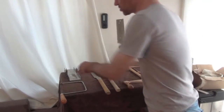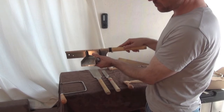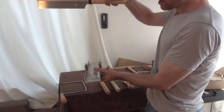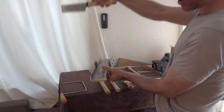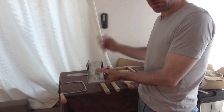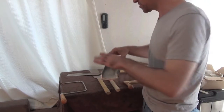When I do fret slots, I have a miter box. A miter box is really important because it means that when you're cutting the frets, you're cutting at 90 degrees. If your saw comes down at an angle rather than straight down, then if you sand away some of the fingerboard, gradually your fret is going to move and it's going to affect your intonation. A miter box is actually a really good investment — it makes your cuts a lot more accurate and the whole process easier.